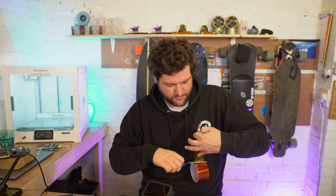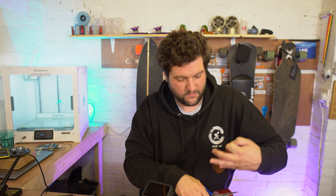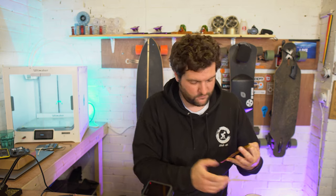Now guys, one other important thing to think about when you're running the temperature wires is you also do not want those crossing anything. So same rules apply, fish paper, Kapton tape, all the good stuff. Obviously, apart from the temperature nib, the sensor nib, that needs to be touching the battery without any insulation underneath it, because it needs to register the temperature.